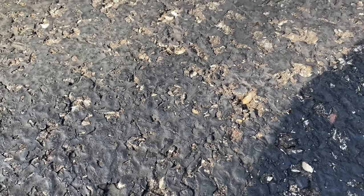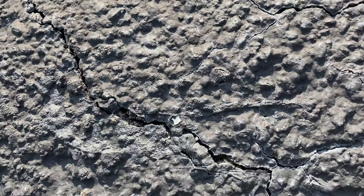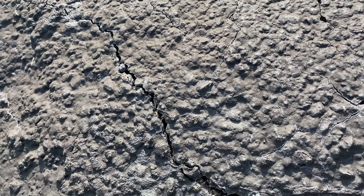The other issue to look at are these thin cracks forming in the asphalt. The problem with these is that as water gets in and temperatures drop, ice will tend to split them open and they will become much, much bigger cracks — including a crack like this one, which is pretty gnarly. So let's get those filled in as well.